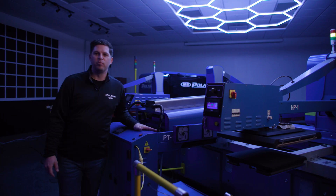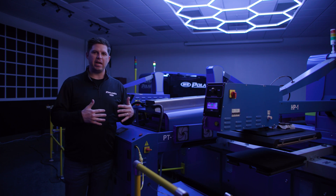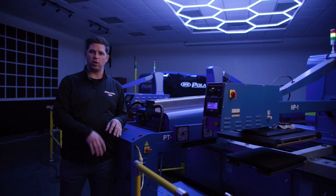After the first heat press we move on to pre-treatment. The pre-treat machine utilizes two nozzles: one for dark shirt pre-treatment and one for light shirt pre-treatment. This is triggered based on the garment type and artwork you're using. We're only using one nozzle per type of pre-treatment to eliminate any banding you may have from multiple nozzles in a line. Within the recipe you can also control the distance the pre-treater sprays along with the quantity of pre-treatment, because different garments and different artworks require different quantities.